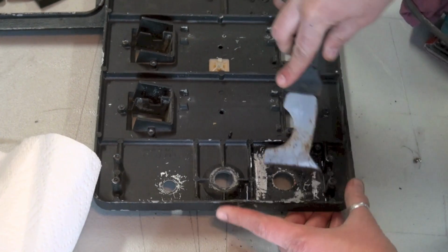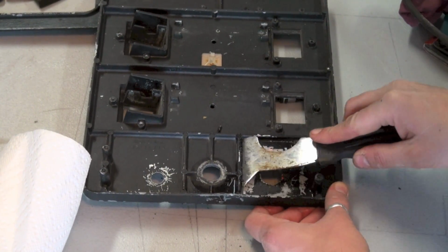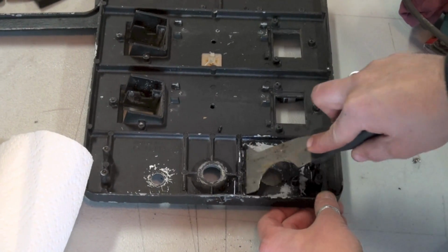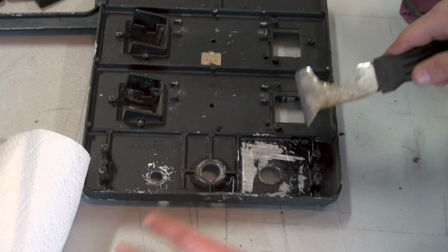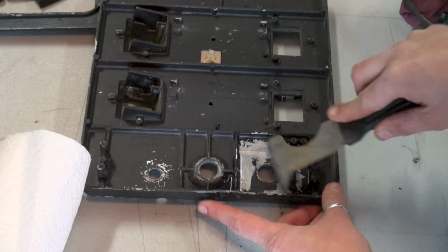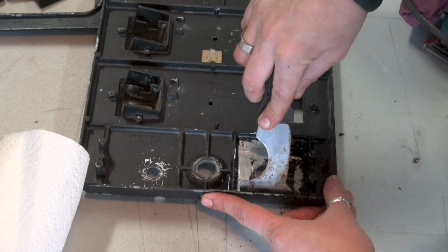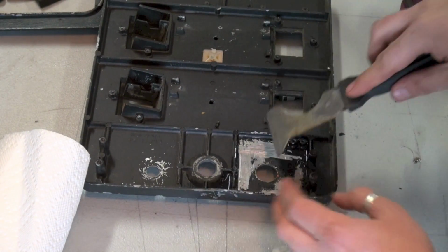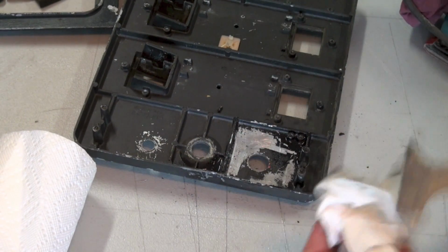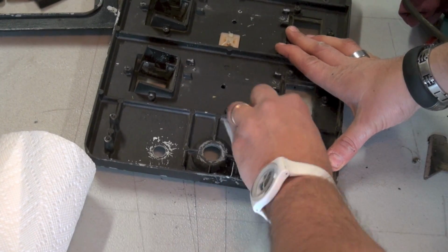And this is also a technique that I would use to get glue off of a control panel because when we did the control panel on the Gyruss, the glue really didn't stay. The glue was so old, it was just dead. But if you have residue like this, use a little bit of Goo Gone and a scraper. I've also used brake cleaner to get glue off, and it actually works pretty well. Alright, that's pretty good. So I think all we need to do now is just get ready to sand this.